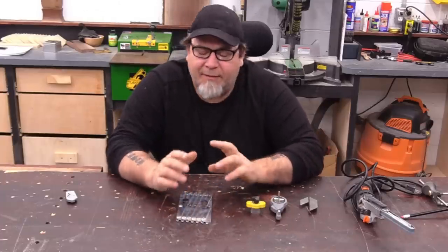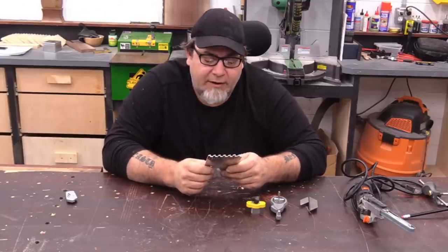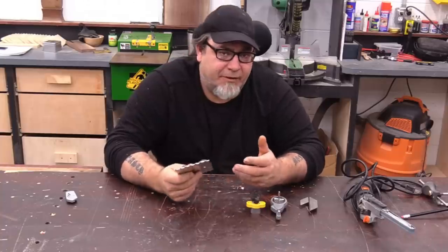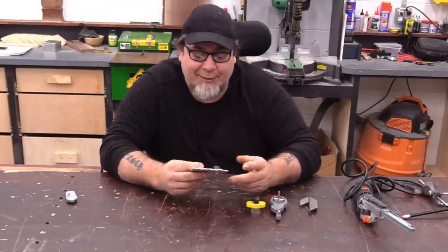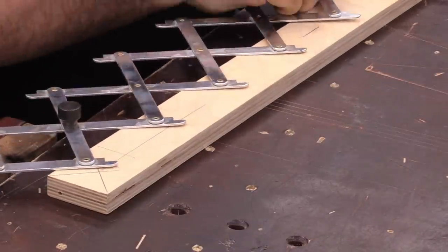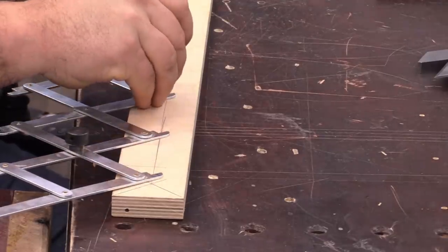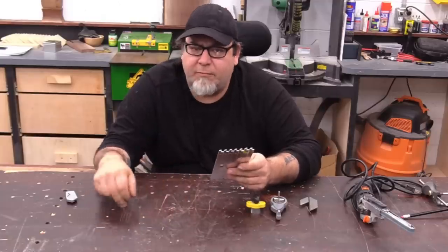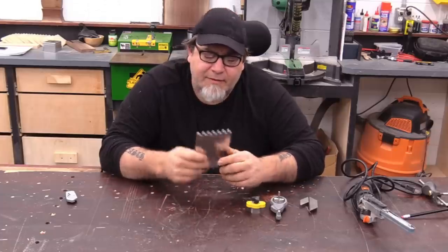Next up, we're going to talk about the MK2. This little tool has cost me more emails than you could imagine — every time I use it in a video I get emails asking where I got it. I always put a link in the description box. This is called an MK2 and it's a divider gauge that divides spaces evenly, so you get even marks between points as it opens up. It's available on Amazon and Klingspor also carries a version. It's great for divisible layout — whether you want screw holes all lined up, marking out for a coat rack, making sure all your pins are lined up.